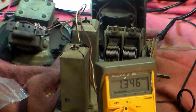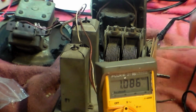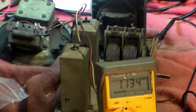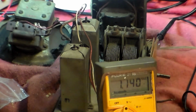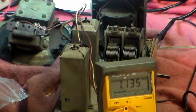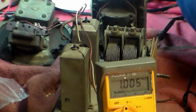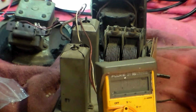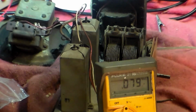Right, here we have the new capacitors have been installed, and the off switch is in there. It's good to be put on the back there, but for now I'll put a link across there where it goes. Okay, that's there. Okay, that's this way here. So if we plug it in now, we should get voltages across various points in here like before. So let's find out, shall we? These will all be AC.